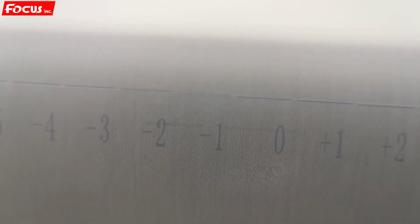First is the color layer, color lines, then it prints out the white lines. From here, we can see the lines. First we find 0. Right now we can see that 0 is not the best. It's overlapped to the top. And then the white for -1 is best. When we go to -2, the white layer starts to overlap to the bottom. So 0 is not best, but -1 is the best. So we find out the best line first. Remember, -1 is the best.